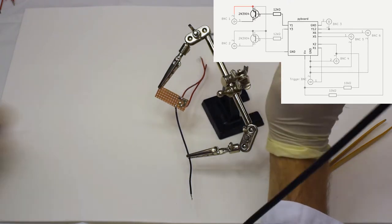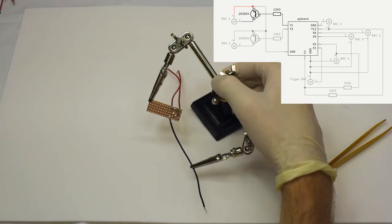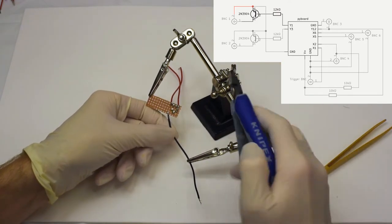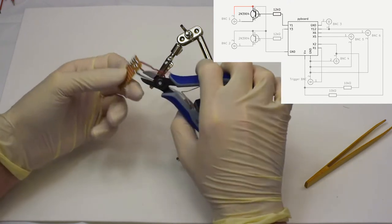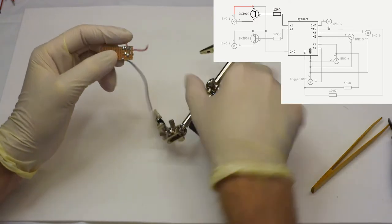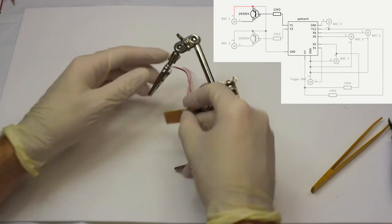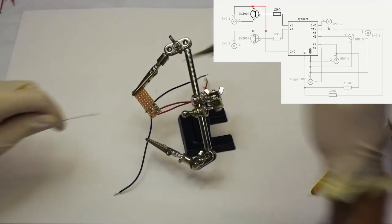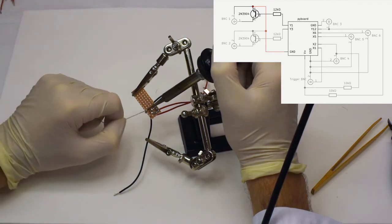And as you can see, this does not yet connect fully back to the pyboard. For that, we will need one more cable, which then allows us to also connect the second BNC connector circuit into it. We have quite a bit of excess metal left on this one, so we snip that away. And here we go with the last cable from this arrangement, which connects the entire circuit back to the pyboard.